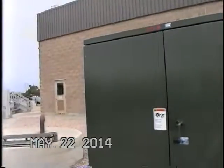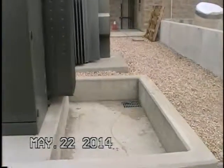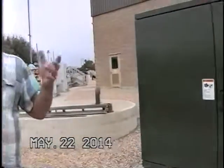And then look at your secondary containment to see if you have any oil down there. If you do, go ahead and shut down. The transformer's going to go bad. These things have a long lead time, so if you start seeing problems, you might want to get one on order as fast as you can. I definitely wouldn't fill up a warehouse full of spare transformers though. That'd be very expensive. So don't do that.